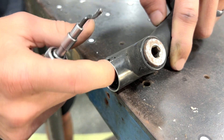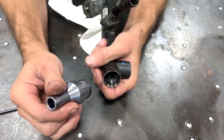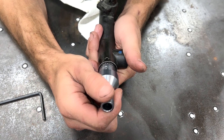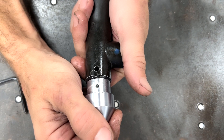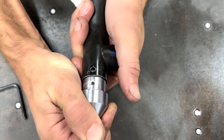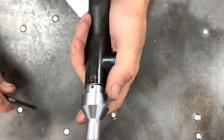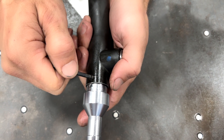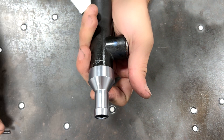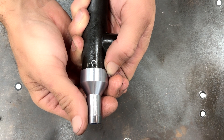Now I'm ready to insert my cooling adapter. I've put some silicone grease on the inside of the tube and on my o-ring — this is not silicone sealant, the o-ring is what's doing the sealing, this is just grease to help everything slide together easily. I'll pre-align my two holes and go in nice and straight, making sure the o-ring is not getting squeezed out of the groove. When the o-ring reaches the drilled hole, I stop, take an Allen wrench or something blunt similar in size to the hole, and push that o-ring back in so it doesn't get cut as I push the adapter the rest of the way in.